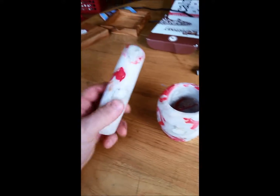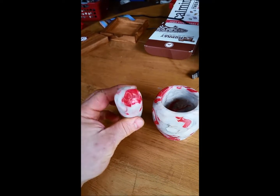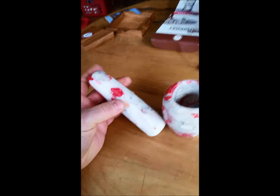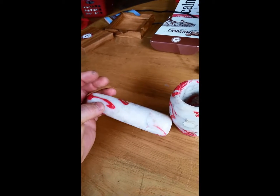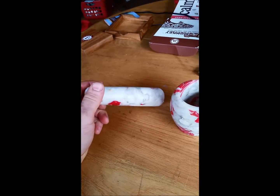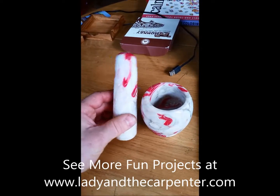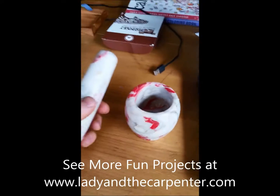And then there is the pestle part of it, which is about 5.5 to 6 inches tall, an inch on the skinny side and 1.5 inches on the big side, just rounded over and straightened out. And then the whole thing is finished with about 400 grit just to give it a little bit of shine. And away we go. And even the pestle, I had to go through and put some epoxy back into some of the bigger holes to fill it back in to get at least solid enough to make a shape that would work. So, fun little project. Don't think I'll actually use it in real life. It'll sit on a shelf somewhere for a long time, but I enjoy doing it.